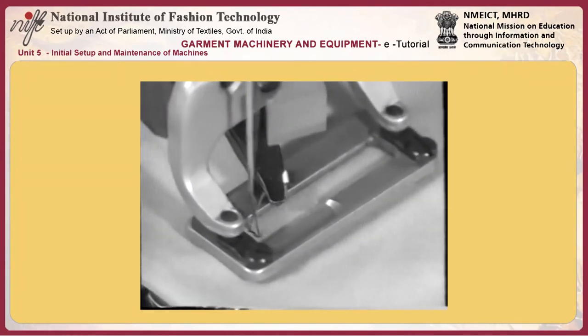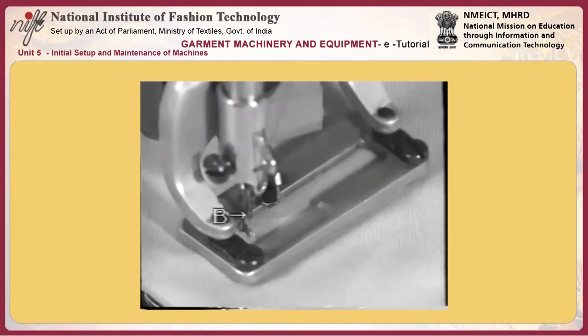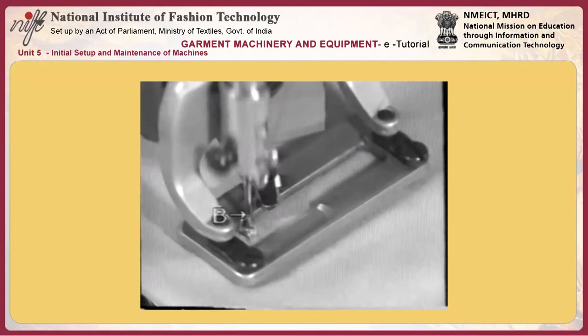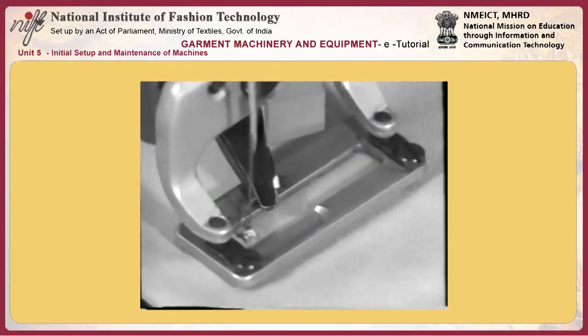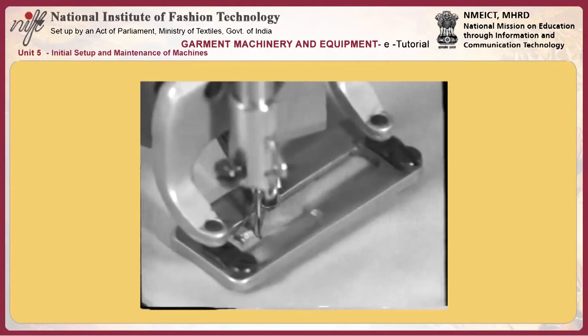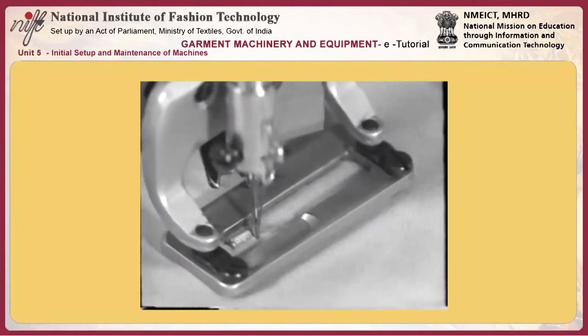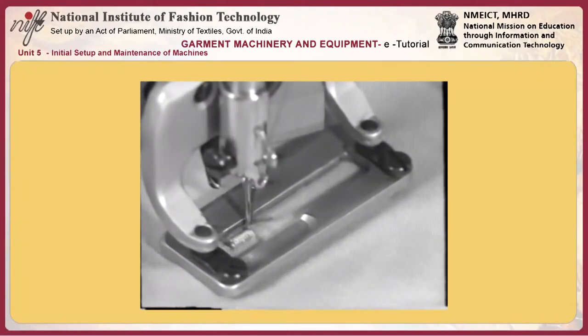When the sewing machine enters the stop motion state, the needle thread trimmer can stop at position P or Q. Check to be sure that the needle thread trimmer securely clamps the needle thread at both positions P and Q. After the adjustment, return the presser bar lifting lever to its hold position.